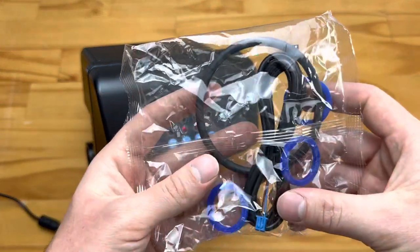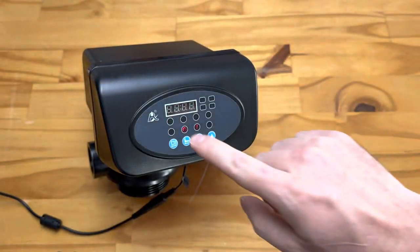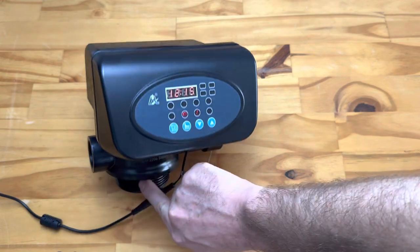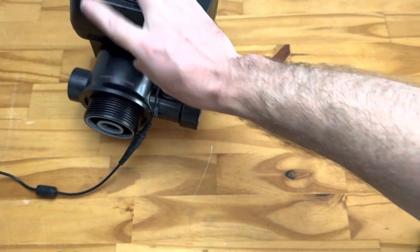About the O-rings on the table: the big black O-ring sits between this backwash valve and your FRP vessel, so it will fit over this and sit in underneath there in that little ridge.